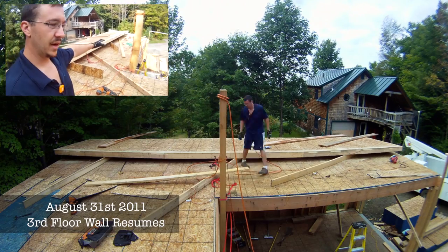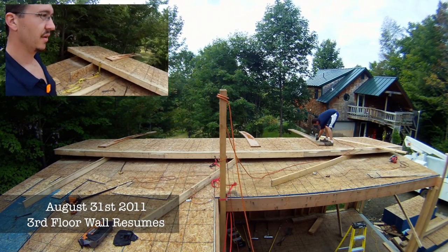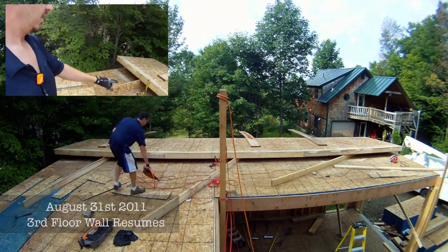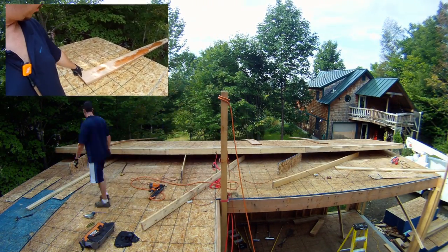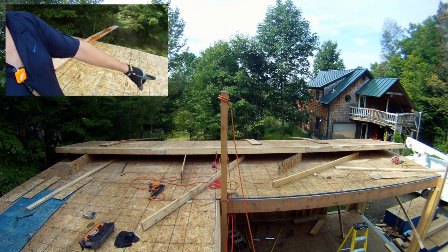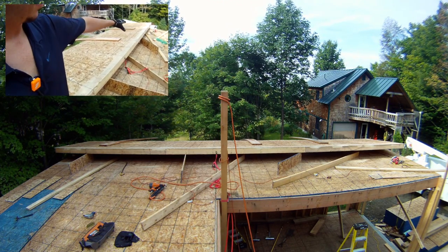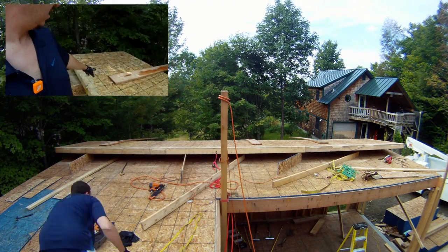So this is what I have. The wall is laid out. I've got it up about 12 inches off the deck. I've attached two-by-12-by-16s with two-and-a-half inch lag screws at two spots, to the king and the jack studs because they're the strongest studs in the wall.